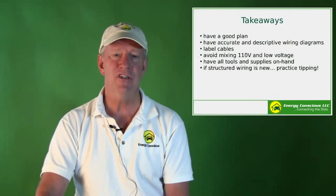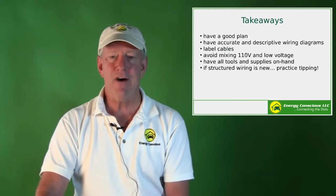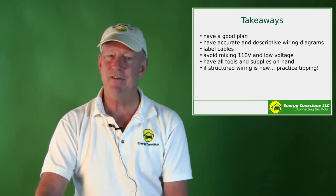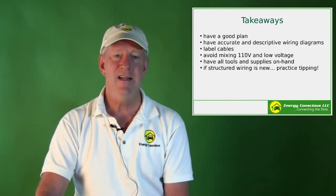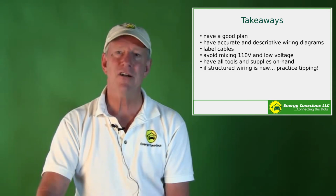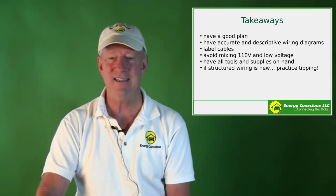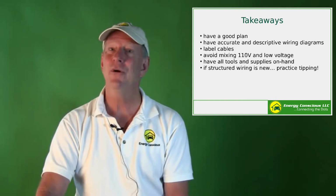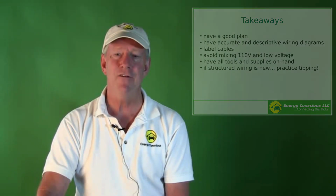So what should we take away from this particular video clip? Number one, have a good plan with good diagrams. Have wire labels pre-printed for the Cat5 terminations. Definitely avoid mixing high voltage and low voltage whenever possible. Have all your materials, tools, and test equipment on hand. And if structured wiring is new to you, practice, and more practice until you're comfortable doing tipping on a ladder, for instance. Most of all, take your time and have fun.